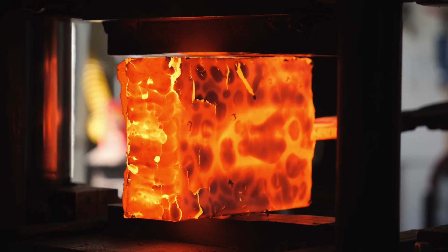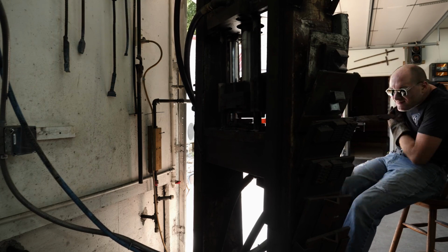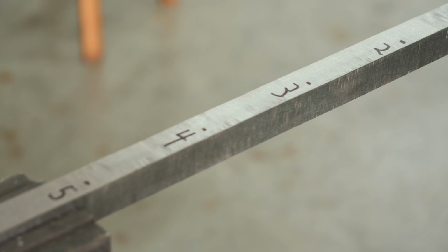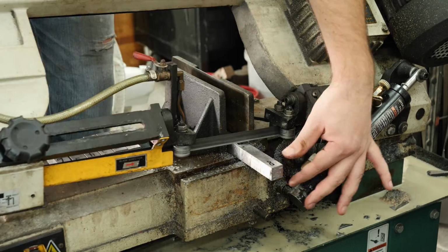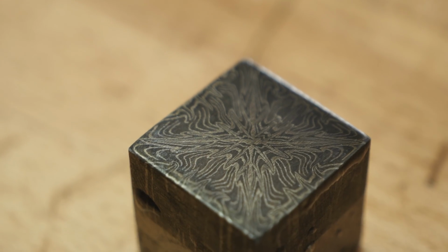In this video, we're gonna tile weld, grind, heat treat, and hand sand our 12-inch Bowie knife blade named Luminous. To catch you up, I've already forged quite a bit on the mosaic Damascus and have it ready to be 9-wayed. The 9-way will make it so the pattern on the end is multiplied times 9.